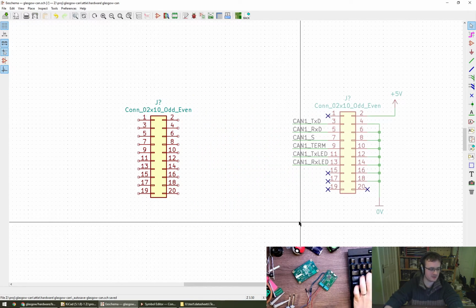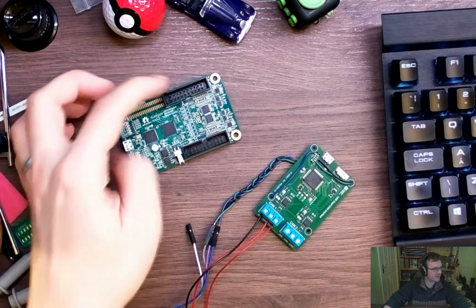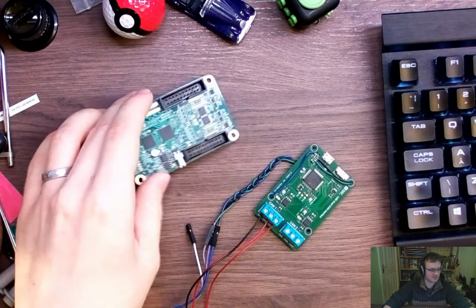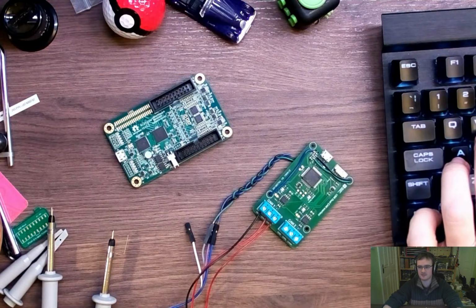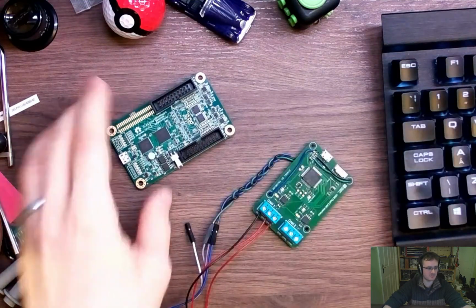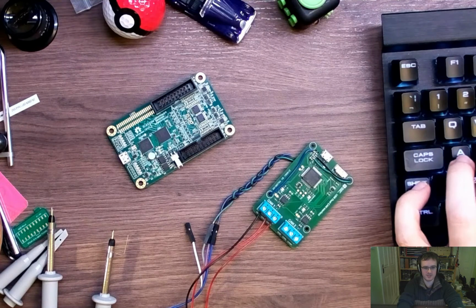Let's put that on connector A. So when I'm drawing schematics, I quite like things to make logical sense with respect to the hardware as well. So this is port A up top, and this is port B. Pin 1 is in this corner for A, and pin 1 is in this corner for B. So what I'm going to do is, if I can, I'm going to rotate that. Rotate, just R, like this. Oh, I pointed the wrong corner, apologies, the internal corner. That'll be the A, and let's just put a little bit of text in there to say port A.